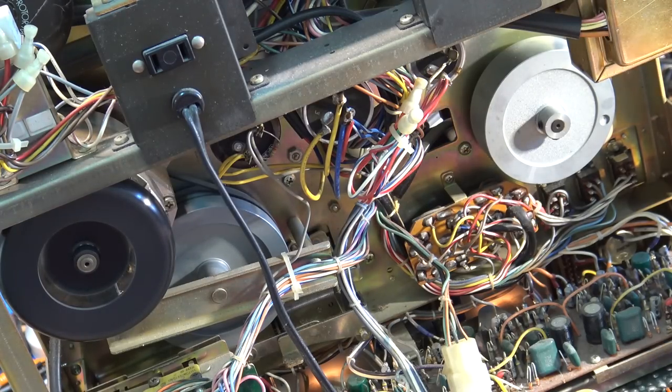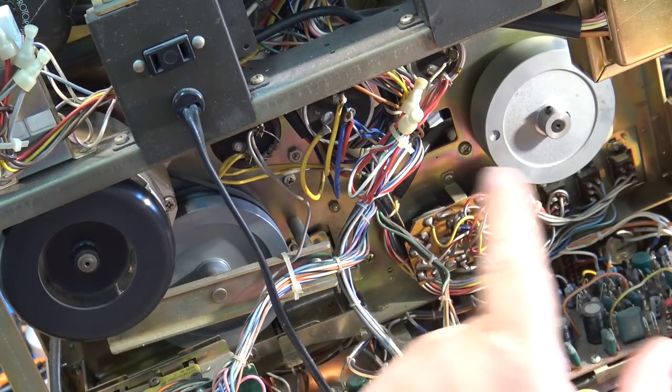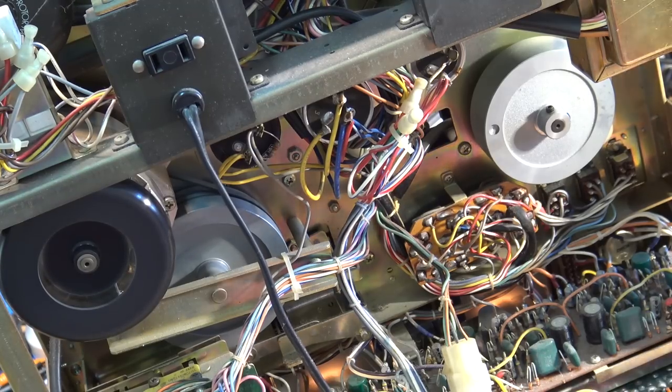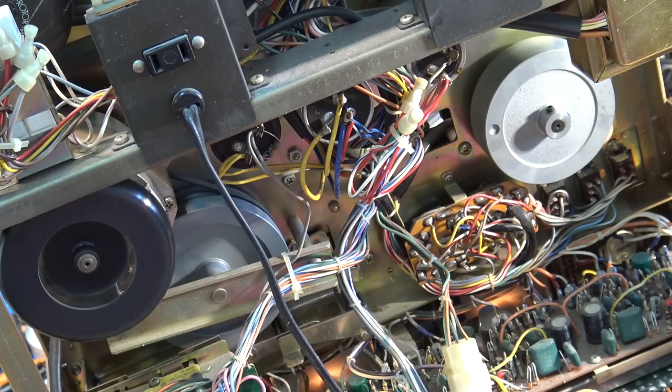I don't know whether there'd be any PCBs in that one or not. This was manufactured in 1975. Some of these oil-filled caps will have PCBs in them, so you have to be careful. And this is certainly around the era when they were starting to ban a lot of those chemicals. So this may or may not have PCBs in it, but you have to treat these things as if they do. So they should be disposed of correctly if you're changing it out.